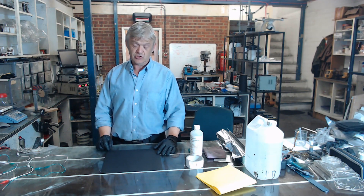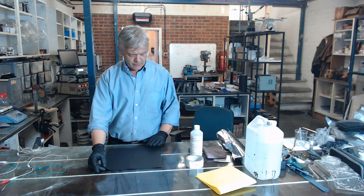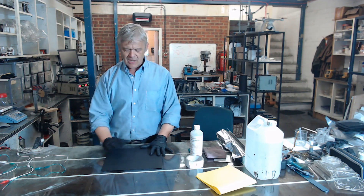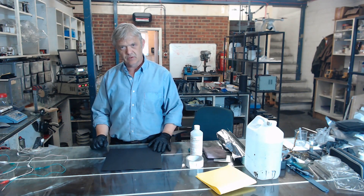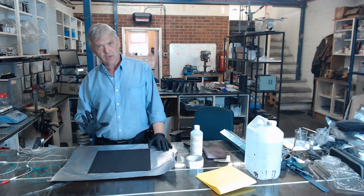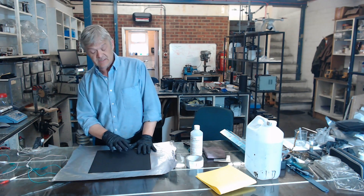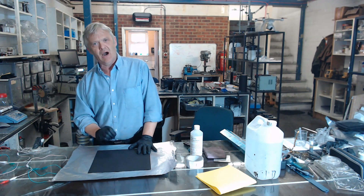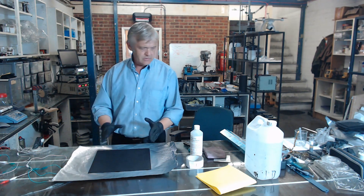It's great for battery cases too — you can coat the outside of plastic so it becomes one of your terminals. For the sunflower motor, I need to coat a bit of HDPE — High Density Polyethylene — filled with conductive material, so it's conductive. It's about a hundred ohms per square across the surface, which isn't a lot, but it's enough to make things a bit difficult. If you just clip on here and plate in one spot, it can get messy.